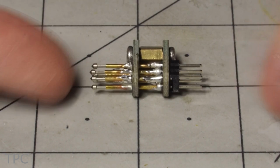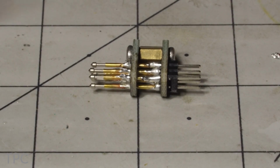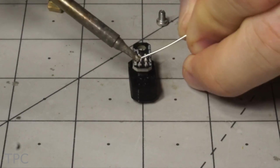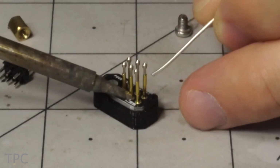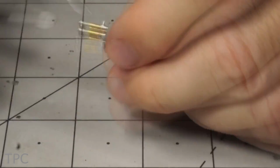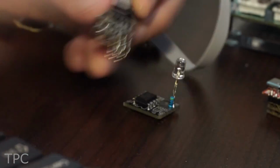It's not a one-of-a-kind jig kit, but what sets it apart from others is that it positions the ICSP connector in line with the Pogo pins. This makes it easy to determine where each pin is going and allows you to swap the single standoff screws to the other side if needed. This makes the ATtiny85 programming process simple.